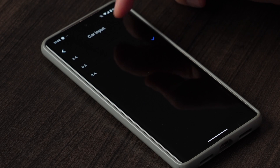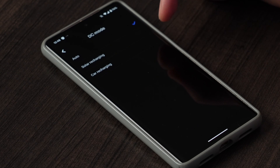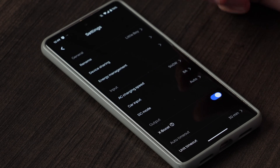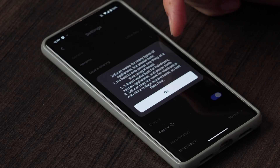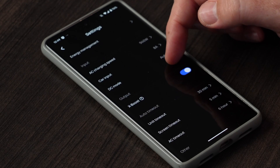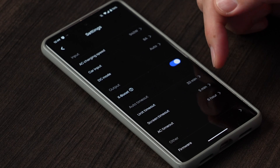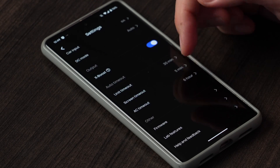You can select whether you want four, six, or eight amps from your car input, and you can select DC mode from solar recharging to car recharging — it's set by default to auto. There's also the XBoost feature, which is on by default. It helps start large appliances such as hair dryers, toasters, microwaves, and power tools, but it shouldn't be used for sensitive electronic devices like laptops and phones, as it may not work for electronics with strict voltage requirements. Finally, you can set an auto timeout function so that if nothing is flowing through the outputs, the unit will turn itself off to preserve battery life. You can also change the timeout for the screen and for the AC outputs.